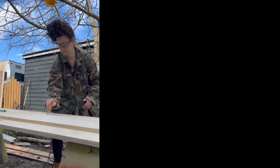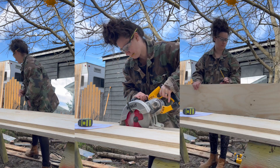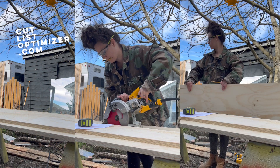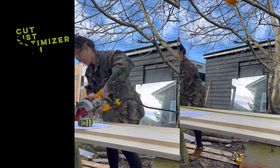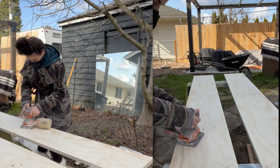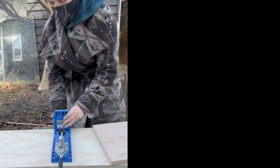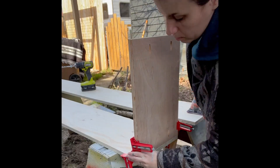The top sections I built from scratch are actually flush against the back wall, so that issue didn't apply there. For that top section of the library I used cabinet-grade plywood, starting by cutting all my pieces. I used cutlistoptimizer.com to make my cut map and use the plywood as efficiently as possible to avoid waste — one four-by-eight-foot sheet and a smaller two-by-four-foot sheet got me all the pieces I needed.